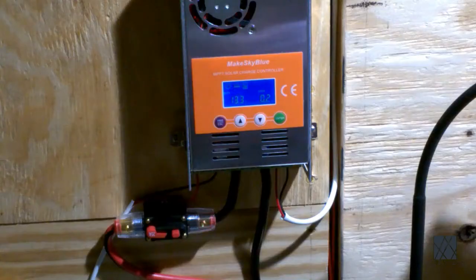One last quick update: this is a MakeSky Blue solar charge controller, currently running my security lighting — charging the battery during the day from a 100 watt solar panel, then turning on the flood light outside at night. This charge controller has a difficult time sensing night and day when used with a single 12 volt panel. It demands over 18 volts before sensing daytime, which is annoying with a panel that only has an open circuit voltage of 18 to 20 volts. Beyond that glitch it's working well enough, so I'm going to leave it running for now.